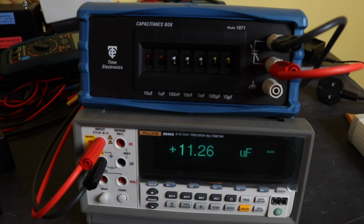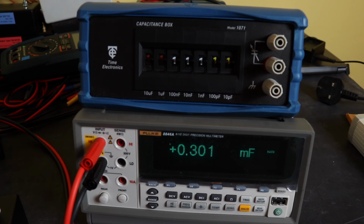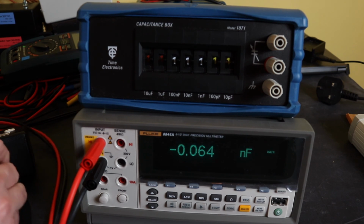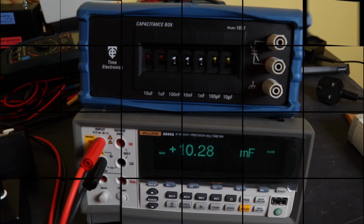It will measure. I'll just pop it into the 300 microfarads so you'll see how close that is. You also see how fast it operates as well. We'll try the 1 millifarad. And that's got 1 millifarad as well. But seeing it on this does tend to show you how inaccurate the MTR105 was. Just flip it onto the 10 millifarad. So there you go, pretty accurate in comparison to the Keysight, to be honest. That was 10.46 when it wants to read, but obviously a much faster reading.